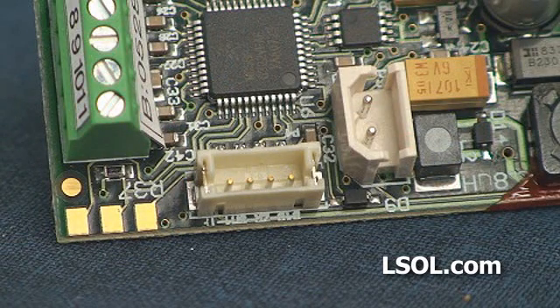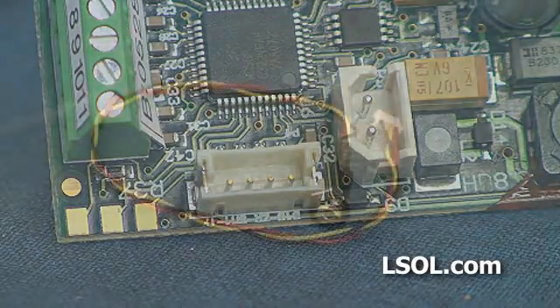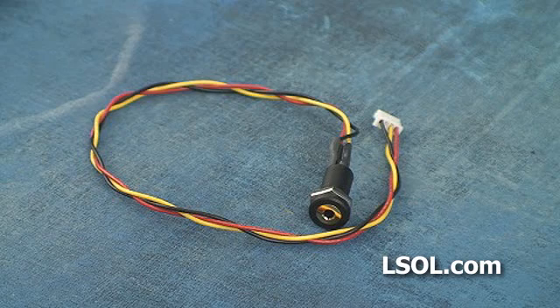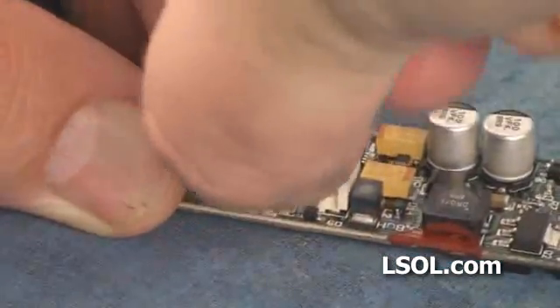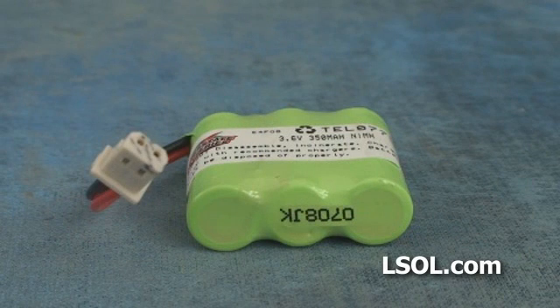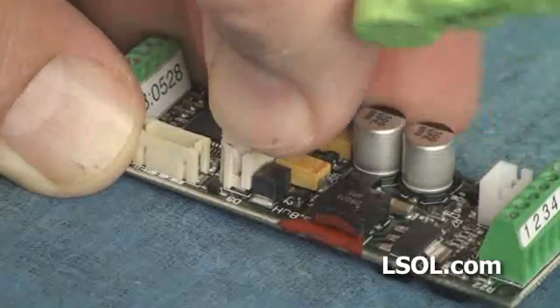The fourth and fifth connectors are used for a computer interface cable and a battery backup for the PB9 soundboard. The computer cable allows you, if you purchase the optional USB interface, to change and alter the settings of your board using a simple software program on your PC — you just plug the cable into the board. The battery backup is used so that the board can continue to run when voltage drops below six volts. The battery is charged by the board with maximum charging occurring at about eight volts. Thirty minutes will bring the battery up to normal operation, while two hours will give you a full charge.